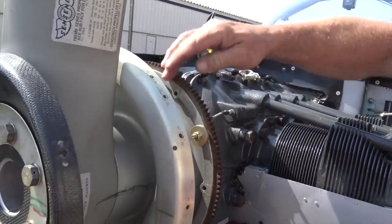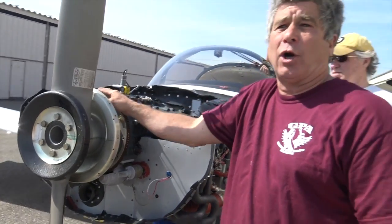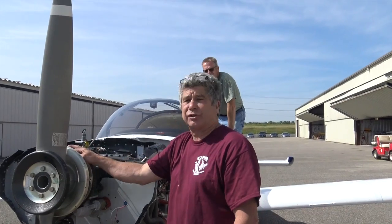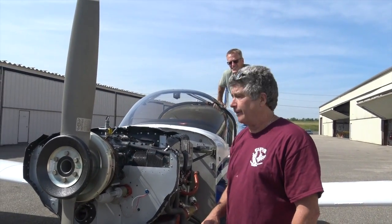Now we're going to take another reading and see where we have to add possibly another weight. If we come in anything under 0.08, 0.07, that's already into the very good, excellent range. We'll just leave it there, but we're going to make one more run now to see where we are.